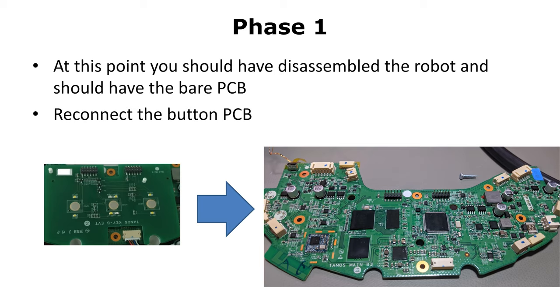If this step was successful, then we want to patch System A because this is now the passive copy. Go back to the directory with the firmware update and run the installer by running bash install_a.sh. If this is successful, you can reboot the vacuum cleaner and the custom firmware should now be installed.